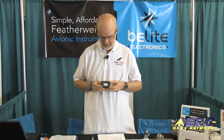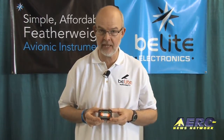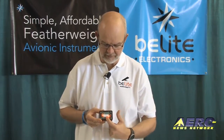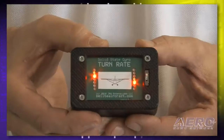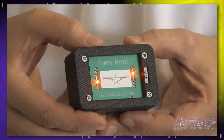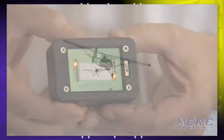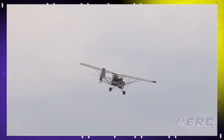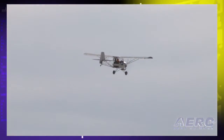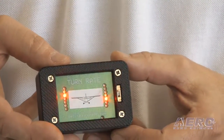This one here is one of my favorites. It's a turn rate indicator, just like a classic turn rate indicator. We have a view of a standard aircraft in the middle of our display, and it's yaw sensitive. As I yaw, I can establish a standard rate turn, and if I yaw in the other direction, it goes the opposite direction. If you exceed four and a half degrees per second, the display will blank — so if we exceed in either direction, the display just turns off.